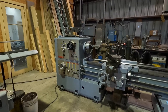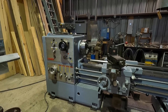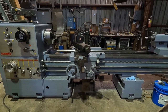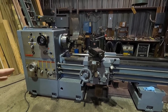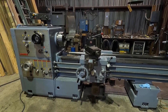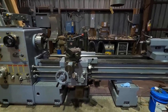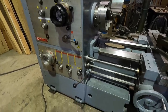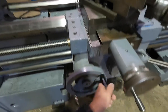He pulled apart and checked the inside of the headstock, but he painted the whole thing, cleaned it all up. And then the only part I participated in was he turcited the saddle, and I came down and helped him scrape the saddle for alignment for the headstock, and then of course the cross slide and that stuff. But he did the rest of it himself. He repainted it, I believe, cleaned it up, put a paint job on it, and it works really well, nice and smooth.